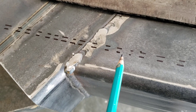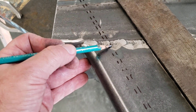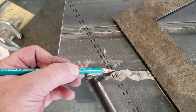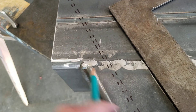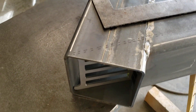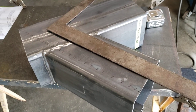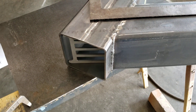You want to make sure that where the air plenum plate meets where you're installing the coal grate, they're at least even — and if anything you can make the coal grate a little bit lower, just a little bit, so that when you're feeding wood in you don't have any restriction. Let me tack this up and I'll add this to this portion.